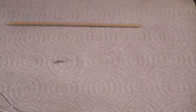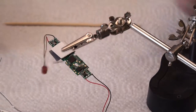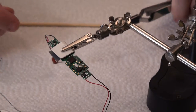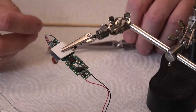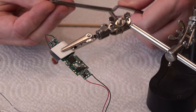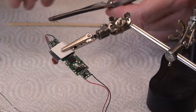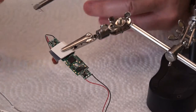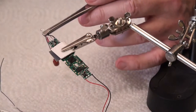Protect that. Helping hand comes in, goes like that, and that area is nicely presented for soldering. Grab these tweezers — they will hold everything in place. Remember, black towards me. These tweezers do a couple of things: first off, they're nice, big, heavy — they act as a heat sink to a certain amount, which protects the LED. Secondly, they help steady my hand, which isn't the steadiest thing. So now, let's give this a try. Position it the way I want it, get my soldering iron.